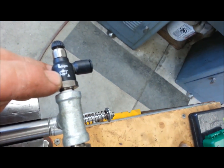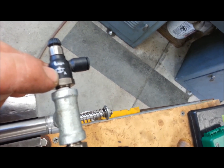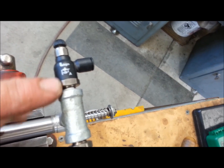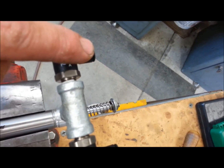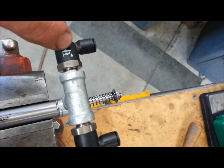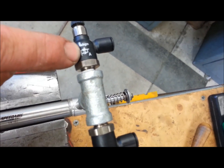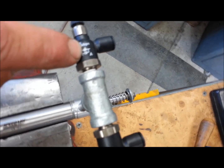The lower character on the valve is a picture of a little round circle, like a ball, and then an arrow. That indicates a ball in a seat, which means this valve is going to check in this direction — it's going to slam shut. But it's got an internal bypass above it, and that's a needle valve, and that's adjustable. So these have an internal check valve and a slight bypass.